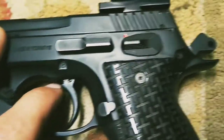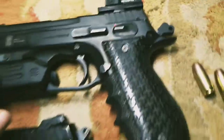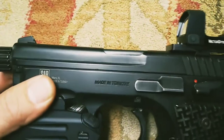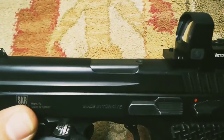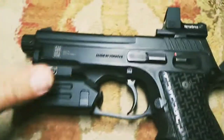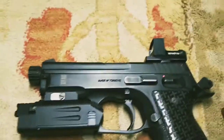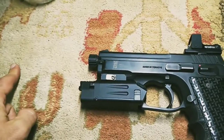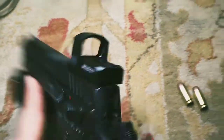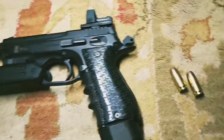The cons: the gun seems to be held together with roll pins, and I don't like roll pins at all personally. Another thing you'll notice is that when you look at the chamber area, it appears angled, but actually the barrel is angled while the chamber face is flat relative to the barrel — so you can see how steep that downward barrel angle is. This can be a problem when using a laser designator because your dot ends up too high and you can't get it where you want. The way I solved that was by putting a little wedge — a guitar pick — in there, and it seems to work okay for the red dot / green dot sight.